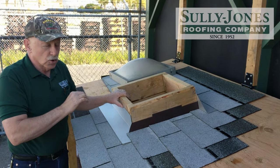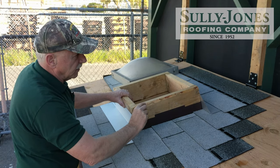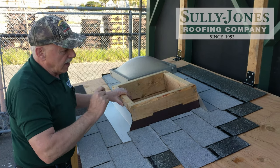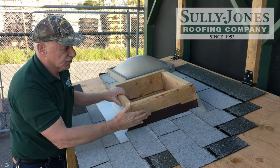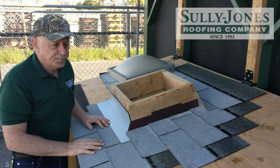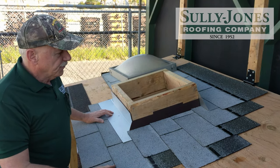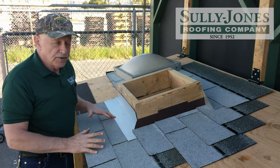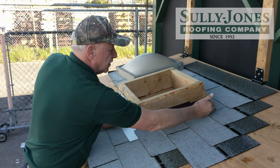If it's going against a block wall or a brick wall, you would cut a groove in the next joint up in your block or brick, and you will install a half by five in that groove to counter flash. Then you will caulk the top of the half by five with Vulkem or a urethane caulking. That's how we want our curbs flashed, and when we go up on the roof we want to see this.